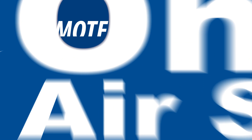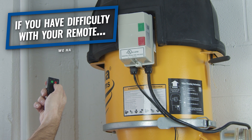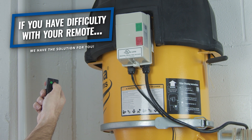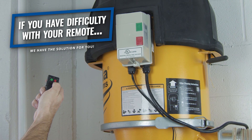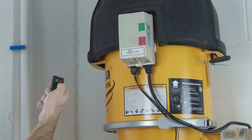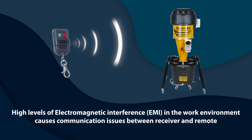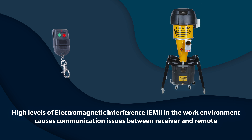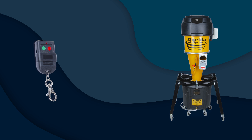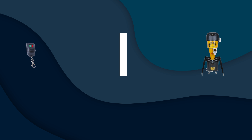These instructions will outline how to help you maintain your supercell for optimal long-term performance. Do you love your supercell but when you want to turn it off with your remote it doesn't work? You press and press and press and the system just does not turn off. We have a fix for you. The reason for this remote problem is high levels of electromagnetic interference or EMI in the work environment, which causes communication issues between the receiver and the remote. Obstructions and distances can also interfere with the remote's radio frequency signals.